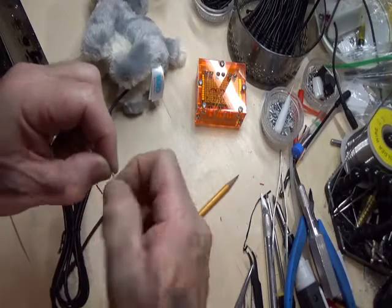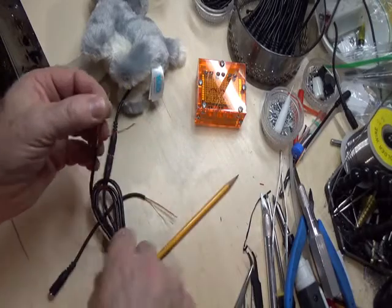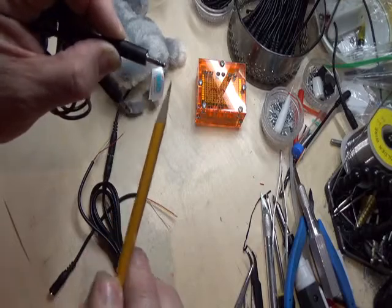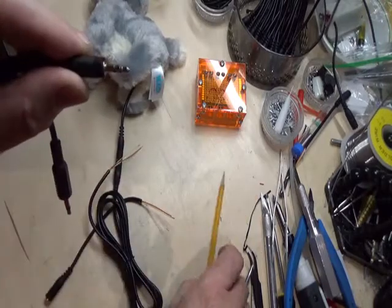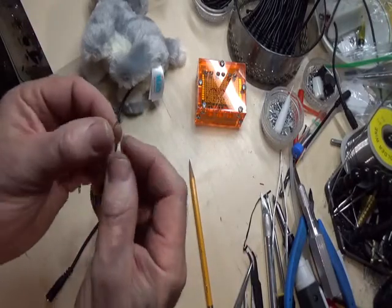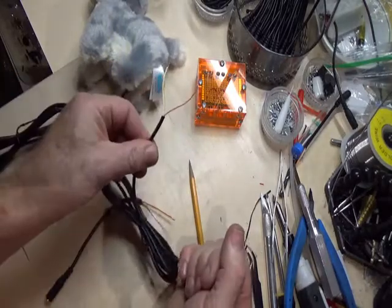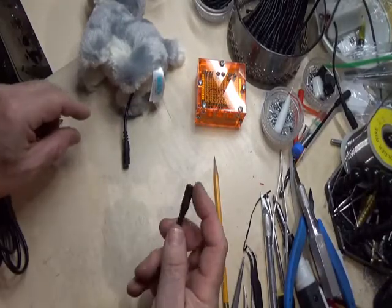Because we know that white and yellow — one of those is the sleeve, the other one's the ring. The red wire on that cable is the tip. We know that because when this toy gets activated, it's activated by these two being common and the red being a separate one. So this is what activates and deactivates that toy. We're going to solder those together and keep that separate, which makes two wires to put onto our switch.